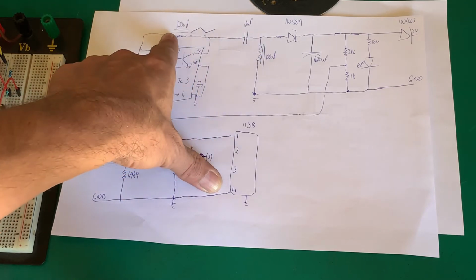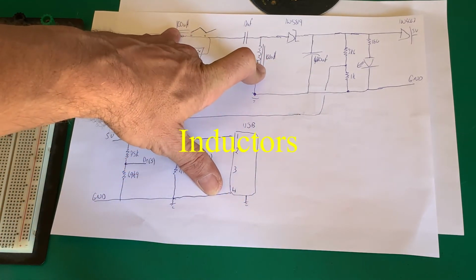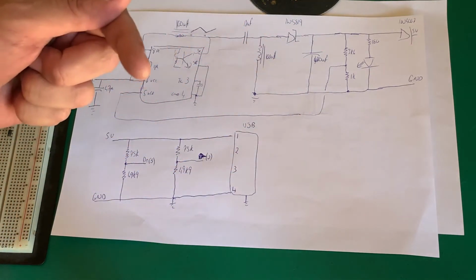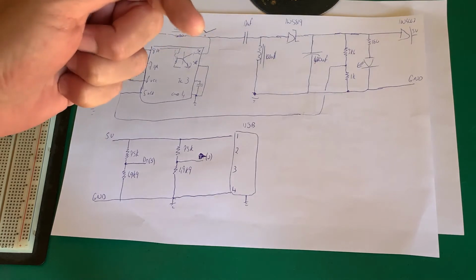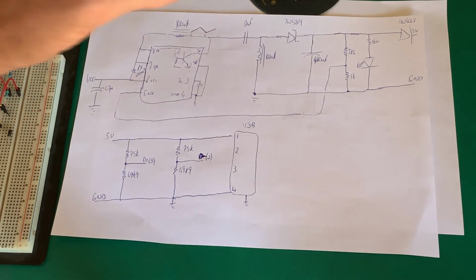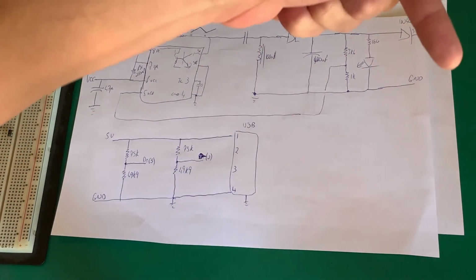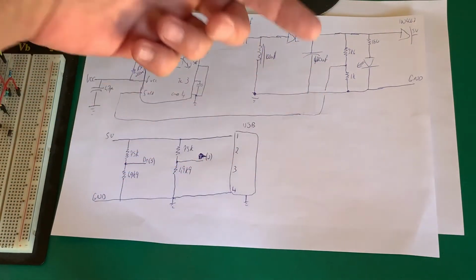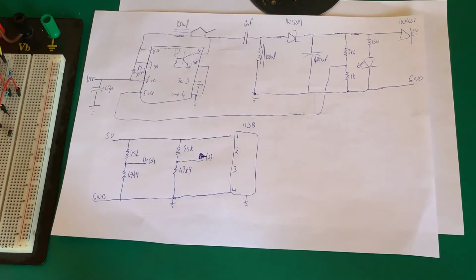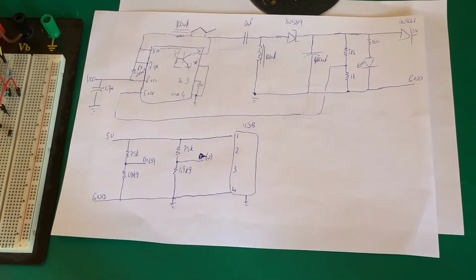In this circuit, we've made that 100 microhenry, we've made that 100 microhenry. These inductors are not coupled. In other words, it's not a single core with two windings around the same core. I don't have that sort of inductor at home. You could do that. You could have a single ferrite core, toroidal core, and you have equal turns around the same side, equal inductance. You could halve the inductance requirement there because your inductive coupling would cancel each other out, and that's one way of doing that.